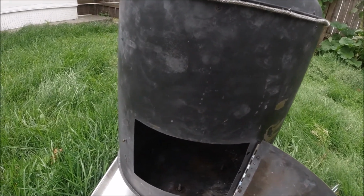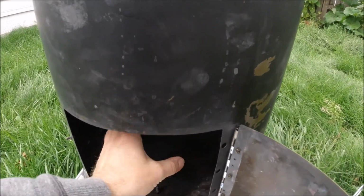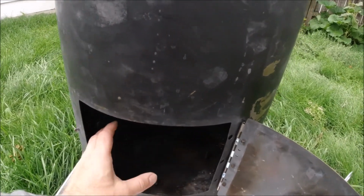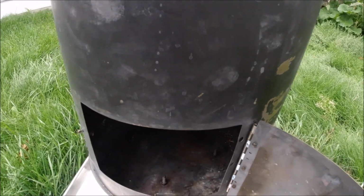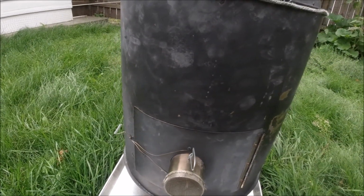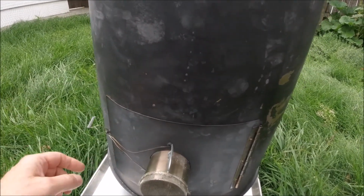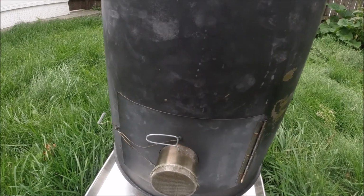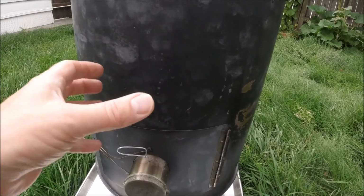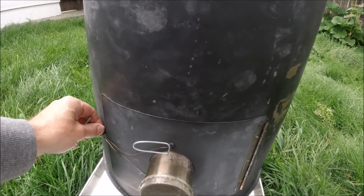And the other problem, the bigger problem, is that if you can't stack things in here and it's burning and you've got a bunch of convoluted structure in there and you go to put another one in and you squeeze it in and it doesn't quite go all the way in and you've got a little lip of the wood sticking out here, you can't close this door properly because of that. This stove can get really out of control. Enough air gets through the seam of the door that you can't close the valve and totally shut down the air in here. There'll be so much suction from the flame and the heat going up the chimney that it'll just keep feeding the fire very ferociously if you can't get that door closed.